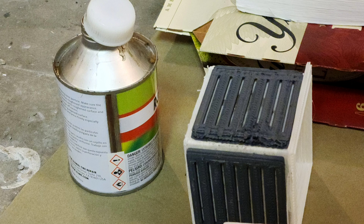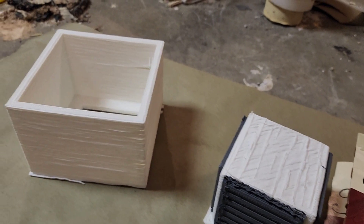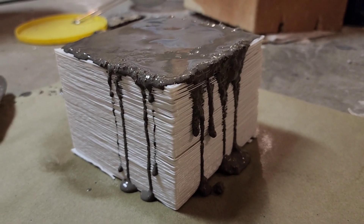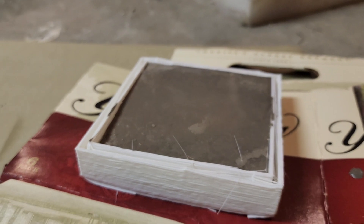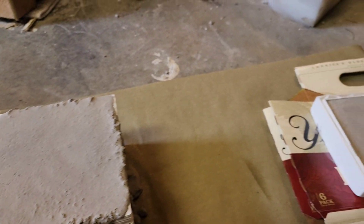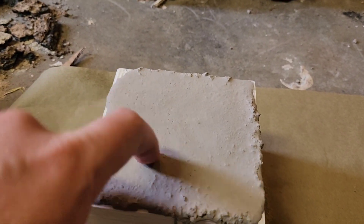The components shown here will be used to cast the microwave kiln. The grayish piece is a silicon carbide element that I printed using Virtual Foundry filament. This acts as a heat collector in the microwave, allowing the parts to be sintered. I'm using castable refractory here, and while this mold was not perfect, it will still work. I've produced a lid and a crucible to avoid arcs escaping in the microwave.